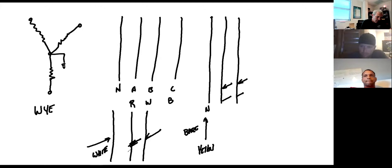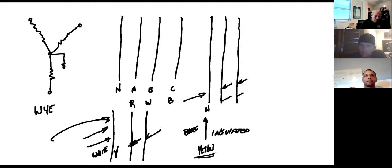Well, I know from my experience out there in the world, I guess they get away with this in an inspection. The electrician puts a marking on this cable, whatever tape he's got on the truck. So if he's out of white, he might mark it yellow, or he might mark it with a red piece of tape. What he's trying to do is designate this wire as the neutral and the other two are hot. So are they really following code? Probably not, but you guys need to look out for one is tape, the other two are not, no matter what the color is. And that's underground, you said? That's both. When you get to the electrician side, everything, overhead and underground, is insulated. On the utility side, our neutral is bare in overhead and insulated in underground with a yellow stripe.